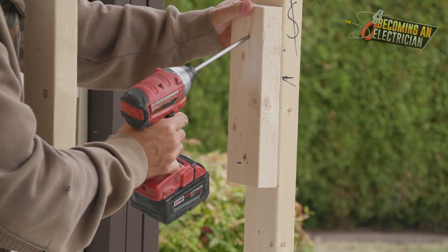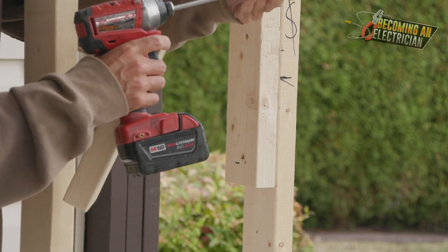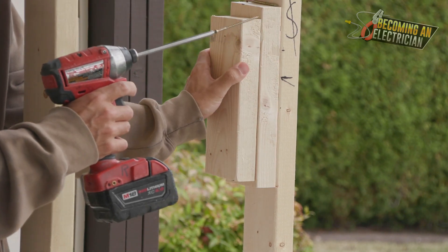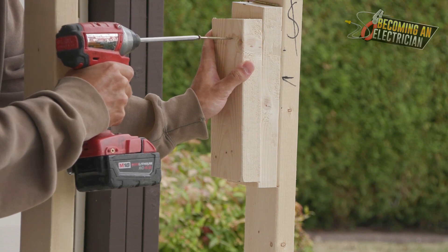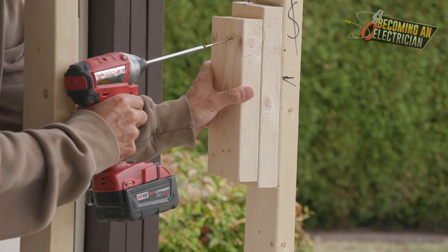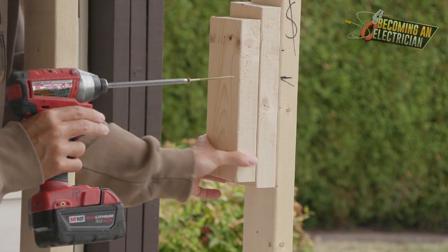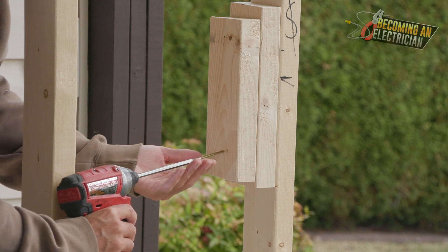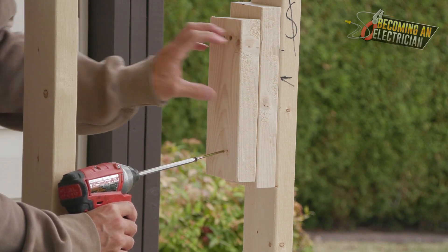I'm going to back the top one off and seat it a little more — that's a pretty good install. Now for the second scab, this one's a little bit smaller. Again, make sure they're flush and screw it in. When you're only using one hand it's a little tricky, so work your way in until it bites and then it's a lot easier. You want to work your way in gradually, then fully drive it. Flush is probably the most important thing so the drywall goes on good and your box installs properly. The second screw is a lot easier than the first.